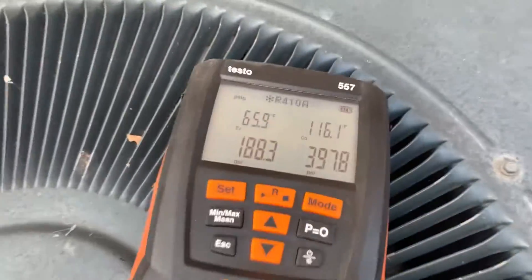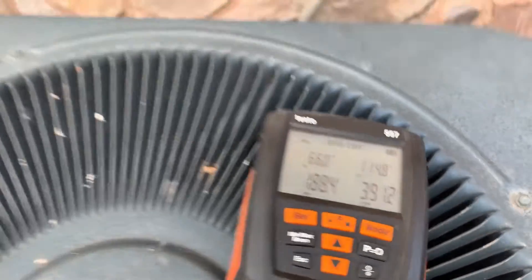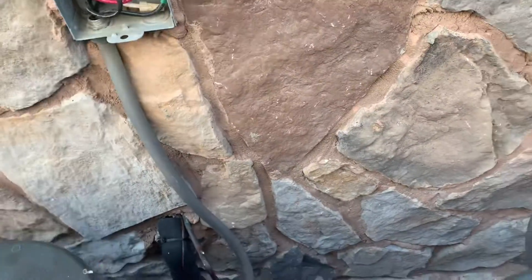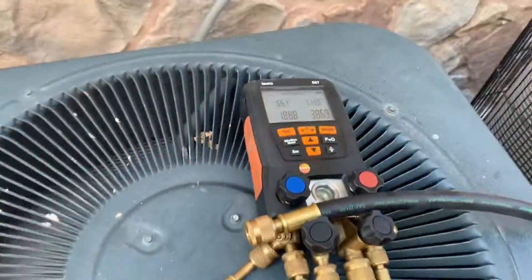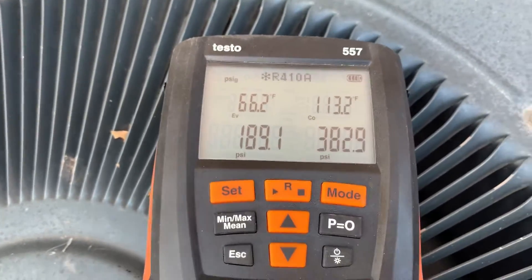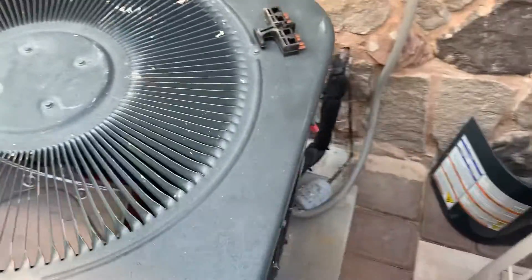And this is taking off for about 20 seconds now. The pressure is trying to balance itself out. Hold it — it disconnects, so it doesn't kick back on again. See if that doesn't balance out. You can get it stuck on the TXV and then it comes around and runs. Alright, let's start with this one, get that one up and running.